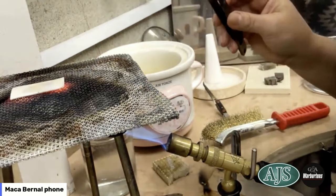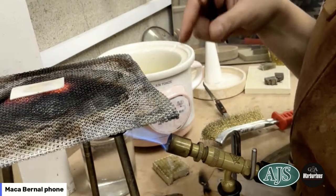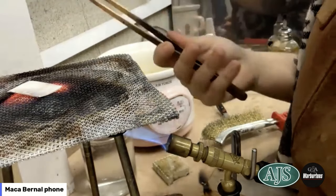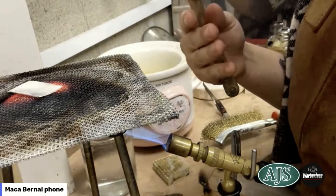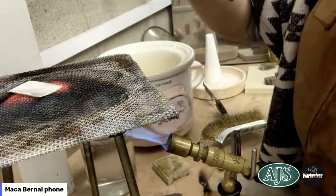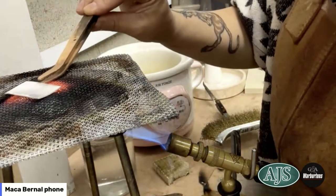With the temperature, I guide myself on color — I've learned via experience that to get that gauze to a reddish state is around 650 degrees. If I torch the piece from the top down I get much more direct heat and it climbs too fast. That's why this setup is better: heating from below through the mesh, it warms up gently and acts as a little oven or kiln effect.